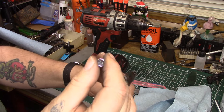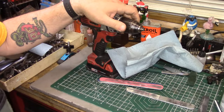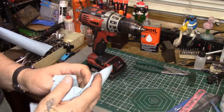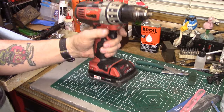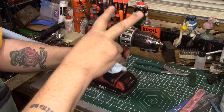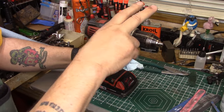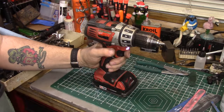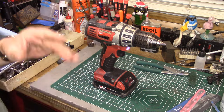It didn't look like that coming out of Singer's factory, but you can do it with a regular drill. What makes this doable with a small drill motor versus a big bench motor is we're going at slow speed — we don't need super high speed to do that. That small buffing motor from Karen's email is not going to have the torque. A drill like this is geared — there's gearing between the motor and the chuck. That other bench motor, calling it loosely a bench motor, the chuck is just on the motor shaft with no gearing, no torque multiplication. It ain't going to work.